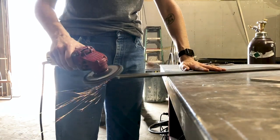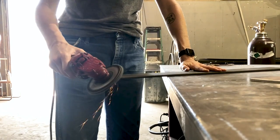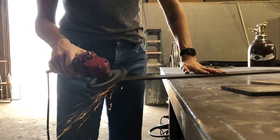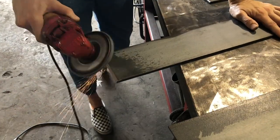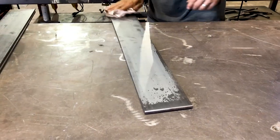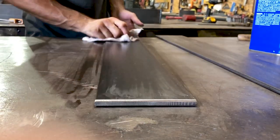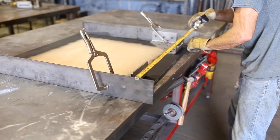To prepare for welding, I ground some bevels into the outside joint edges of the metal with an angle grinder. These bevels create room to get good penetration and make for a strong weld. We then cleaned up the cut pieces with some acetone, and then we clamped the frame together with some right angle clamps to make sure our cuts were correct and everything was square.